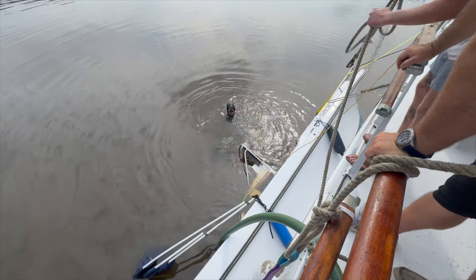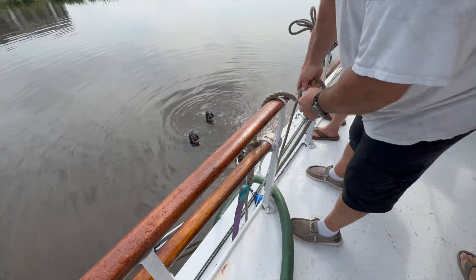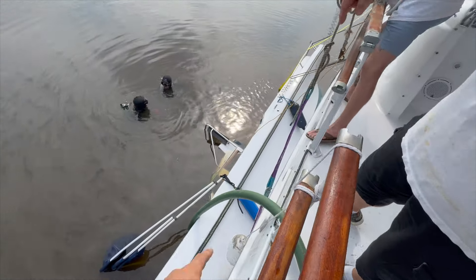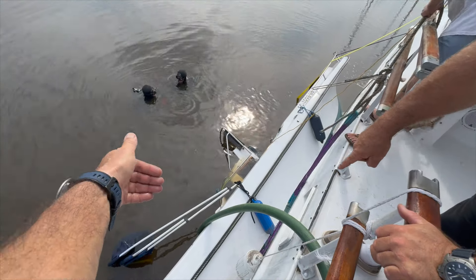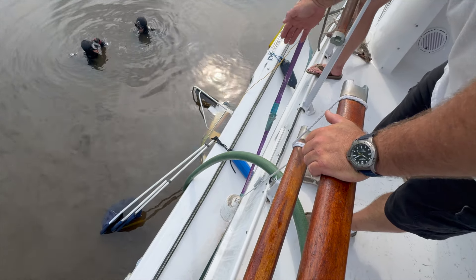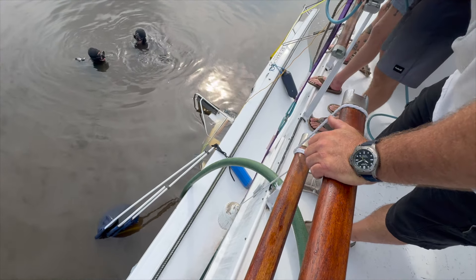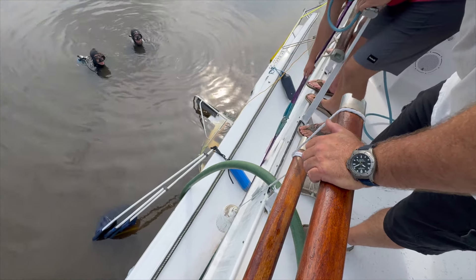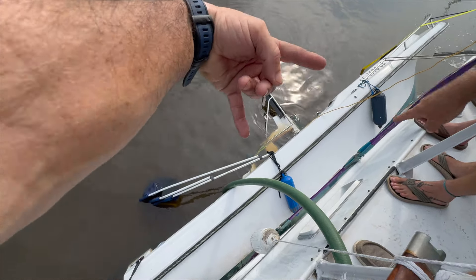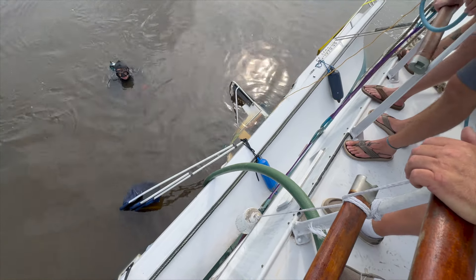What you got? And two — it's good, it's rigged. So what these guys have done is they've hooked up the lift bag underneath the gunnel on the other side. If you can imagine, this is the gunnel right here — on the other side, in the water. It mirrors this, just like this but the opposite side. So what we're going to do is tighten up this strap underneath it, put air to the lift bag, and rotate this up. This strap right here goes all the way underneath the boat. It's attached to the bag, and they've attached the bag here and here to make sure the bag doesn't roll up or come out. So the whole boat comes up as one — it rotates.